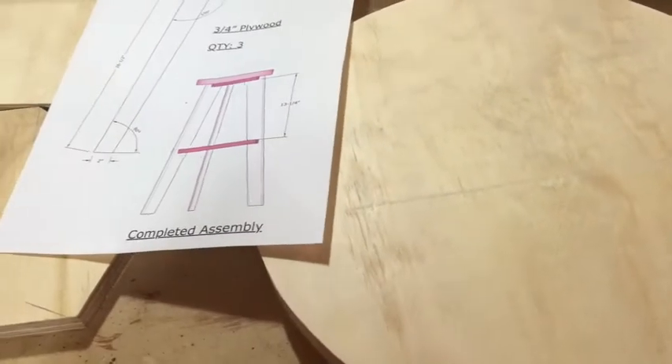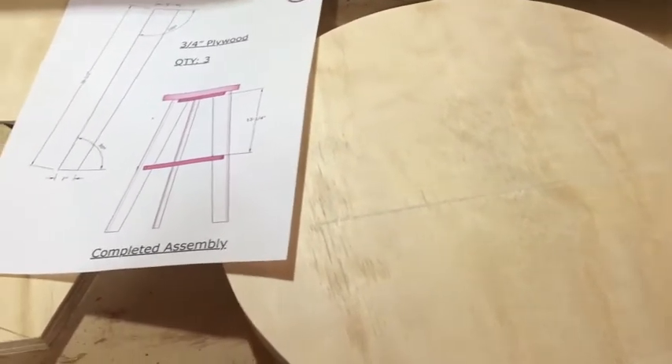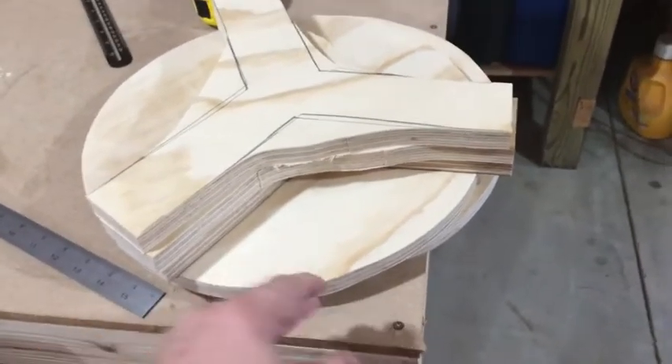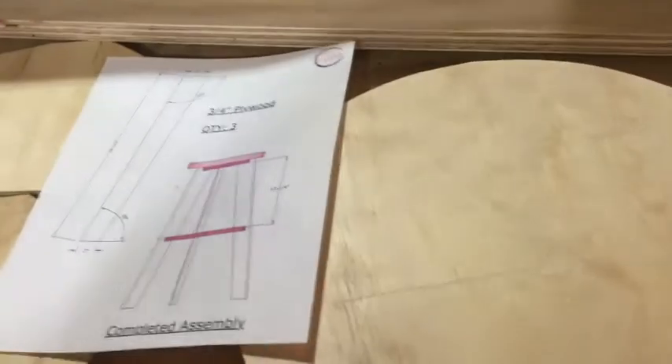So that's the project we're playing with — more to come. I ended up using my bandsaw more. I was using my jigsaw to start with on these circles, because it's in a big piece of wood. I then realized if I can cut it down to a smaller size to fit in my bandsaw, it's going to get a better cut.